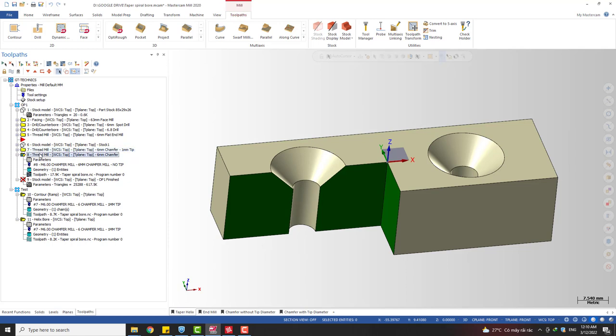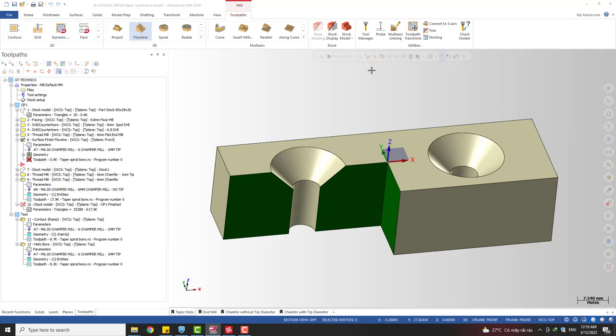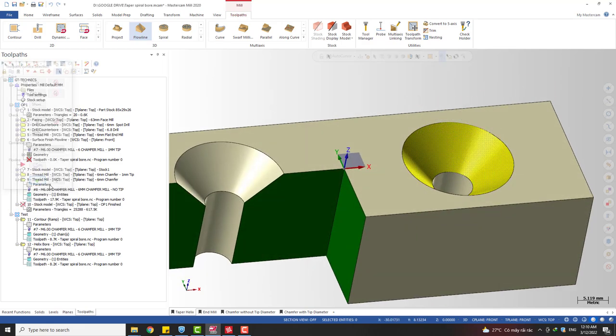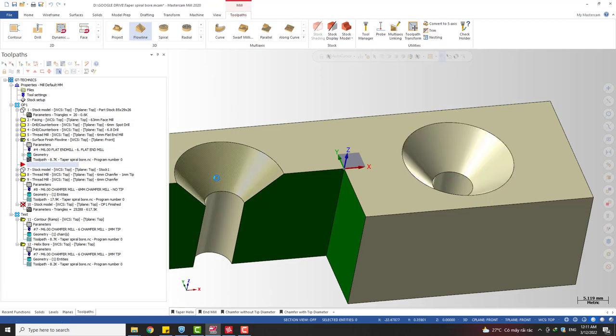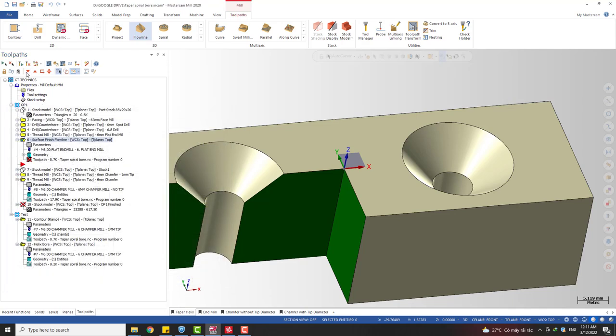And we also have another option to do this, so you don't need to do any calculation. That's using a 3D toolpath, and one toolpath that you can use is the flow line. If you want to do a spiral movement, you can use this flow line with a surface. And just need to select the right cutting direction. And when you go here, you select spiral and then put a step for the cut. Oh, sorry, wrong plane selected. Should be top. Okay.